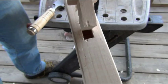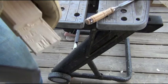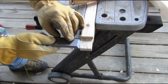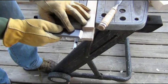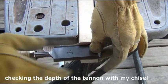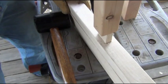The tenon is still a little bit too thick and just a little bit too wide. It's starting to fit but it's getting caught. A lot of the times it's just the tips here are at a slight angle, so all I have to do is trim the tip a little bit and make sure it's nice and flat. So that's going to fit. I'm going to try to fit this into the mortise — it's still a little bit too big.